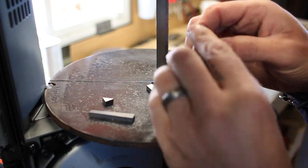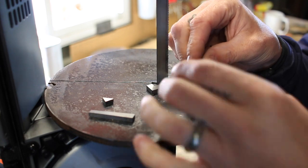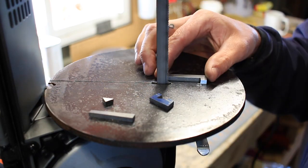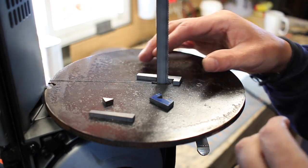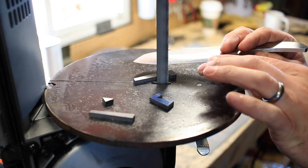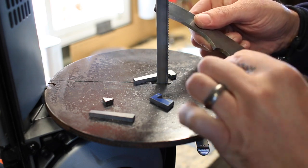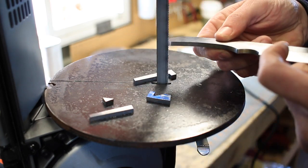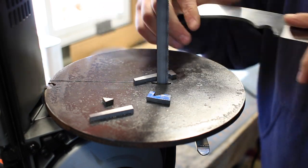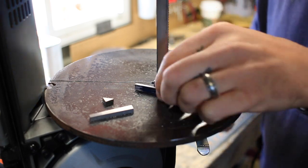You can see how effective this thing is — really quick cuts, really clean cuts. It's not hot, not a lot of burrs — way less burrs than using abrasive cutting discs with an angle grinder. You can handle your material right away after you make these cuts. Really easy to follow your lines; things just ride through nice and true. Also, if you're doing curves you can actually follow some pretty decent curves. The belly of this knife I actually followed entirely on the bandsaw. You can come through and just remove all this material rather than doing multiple cuts.